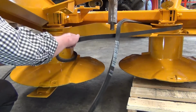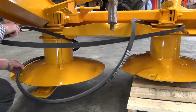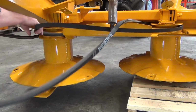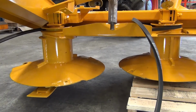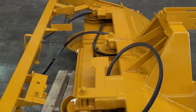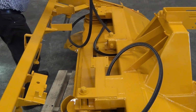Hold the same length of the belt and create a loop by your right hand. Feed the belt into the gap in the ring. Rotate the rotor anti-clockwise until the belt is pulling from the front of the number 1 rotor directly across to the back of the number 2 rotor. Complete the loop that naturally forms, as this will go around the drive head and the idler.